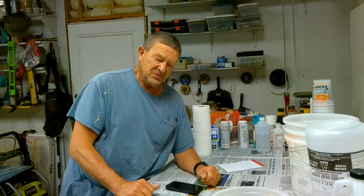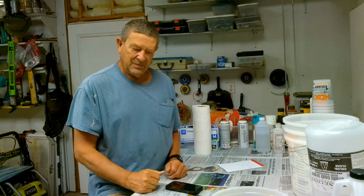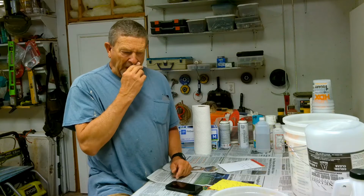So there's one piece of this that I wanted to tell you about, and this is the vital piece. You have to be able to figure how many square feet of surface you've got, and convert that to gallons or ounces to determine how much chemical you're going to need. In the case of this countertop, I went to the Stone Coat Countertop website. And here again, I'm not promoting those guys at all. They're not sponsors. I'm just telling you how I do it. They have a little box there where you plug your numbers in. You plug in length and width, and it'll spit out how many square feet and how much epoxy you're going to need to do the job.